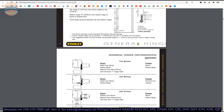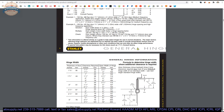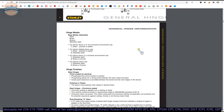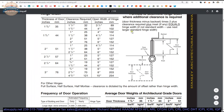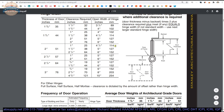If you work with hinges at all, or are just curious, or need detailed information about the right hinge to use, you'll want to scan through here. An example we just scrolled past: determining how wide a hinge you need based on your application — will a 4x4 work? Does it have to be a 4x5? Will a 4x3.5 work? The formula here will help determine best practice. You want that vertical axis of pivoting as close to the center of the thickness of the door as possible.